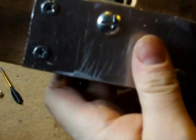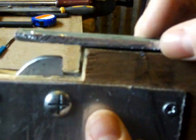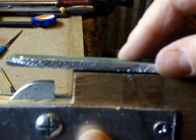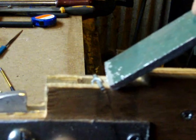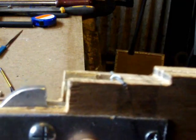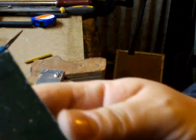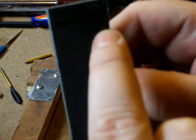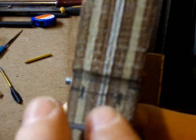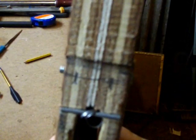Also, if your pin is sticking slightly up, file a little bit out of the metal or wood so it sits down further — mine's rocking a bit. Two things you can do: either make the groove lower or make the groove in the metal. It'll probably be easier to make the groove in the wood deeper. When you come back you should have the two holes drilled and ready to fit. You could use an awl but I recommend you drill the holes to make sure the wood doesn't split.